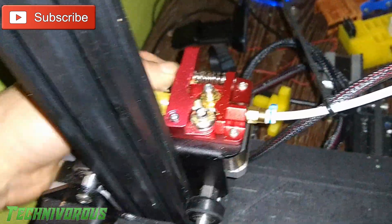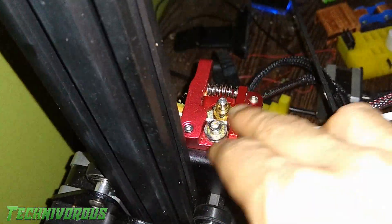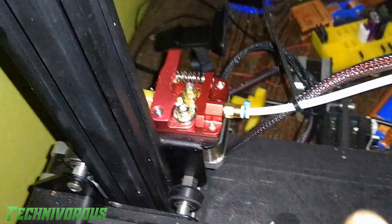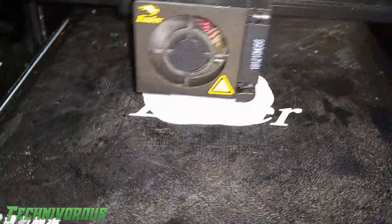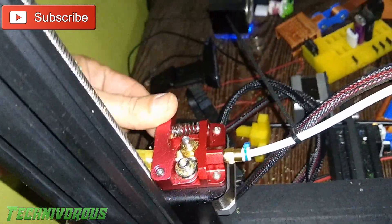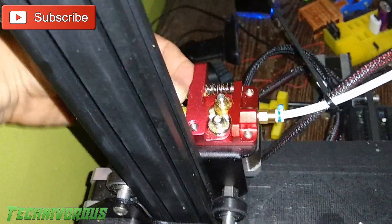On your journey you will experience everything from clogs to filament binds to under-extruded prints. Each of these is to be handled one at a time. After you go through these issues, you will be much more familiar with the machine and capable of most upgrades with little to no explanation. Getting a good print can be addictive, and once you have your settings dialed in you'll inevitably want to upgrade something. But there's no need to jump to that right away, as changing too much can lead to problems. If you don't upgrade one item at a time, you may not know what's causing your issue, leading to tons of frustration and likely going back to stock and doing it piece by piece.